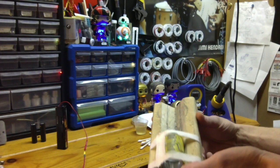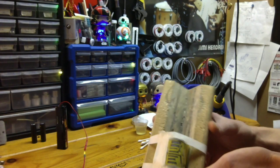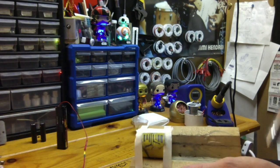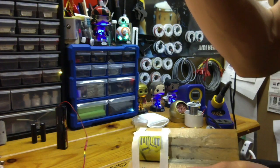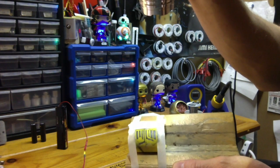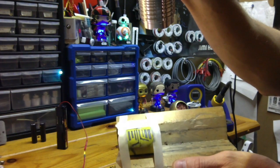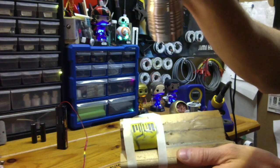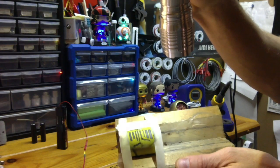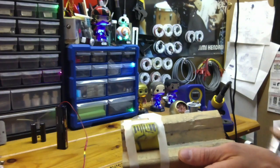There's a million ways to put your pattern on and to provide a resist, which is just protecting all the areas you don't want etched. But you can see all I did, just quick and dirty, just for the sake of testing, to see how it works. I just, old school, threw some tape on the piece and took an X-Acto and just cut out the pattern. This one here is just like an edge connector type pattern. Just random shapes, just messing around here.